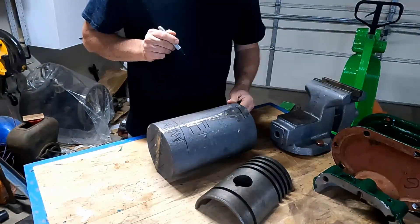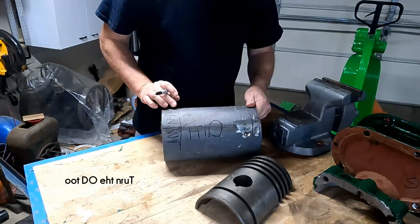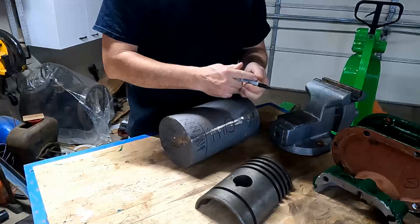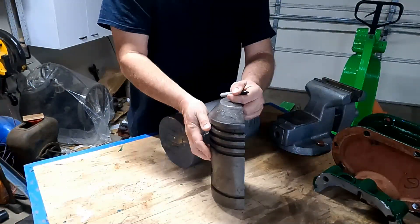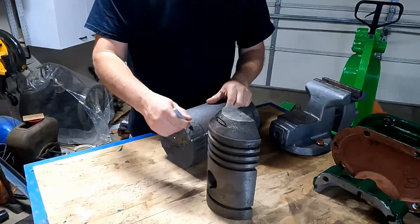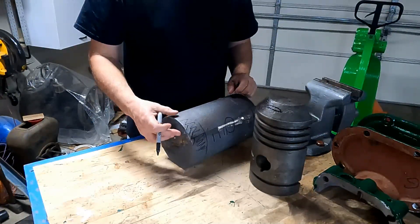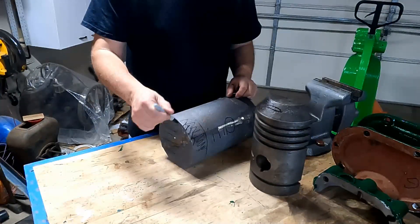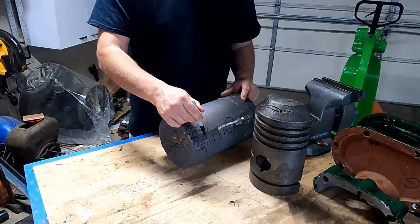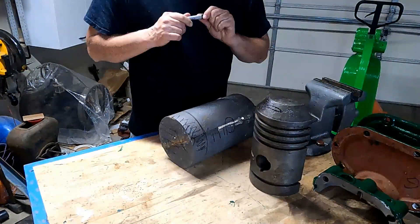There are five ring grooves, and then we'll do the wrist pin hole as one of the last operations. The very last operation is the taper on the head end — you can see this one has a taper machined in. I cast this piston square so it would be easier to hold in the lathe chuck for the other operations, and then the last operation will taper this end. But for now in this video we're focusing on the head end and machining a true surface for the lathe chuck to grab.